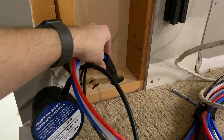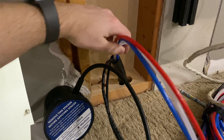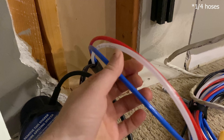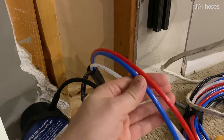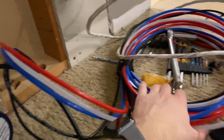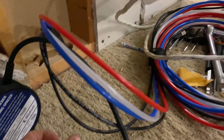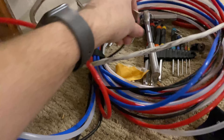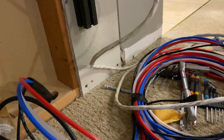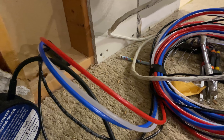For conduit I used a bit of that little black sprinkler piping for drip irrigation — gave me a nice easy channel to run my tubes in. I ran three lines: one for auto top off and two for the auto water change — one to suck water out and one to add it back in. I gave myself lots of extra tubing so we'll figure out where it's going to go. I also ran a USB-A cable which you can use for the Apex, so if I put a power bar downstairs I can control stuff with it for auto water changes and other things.